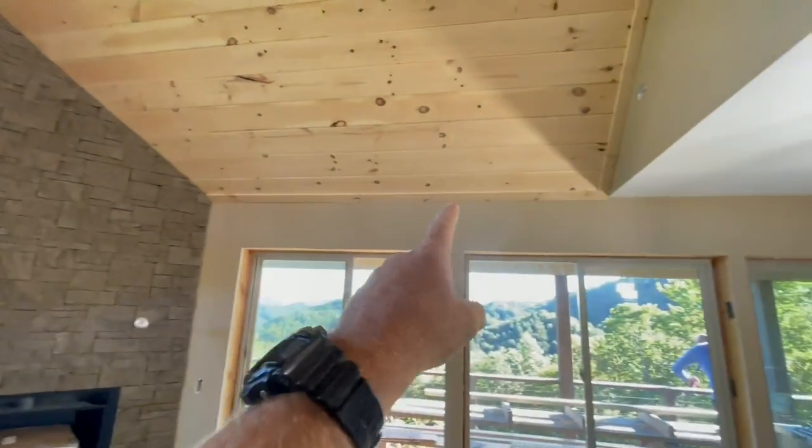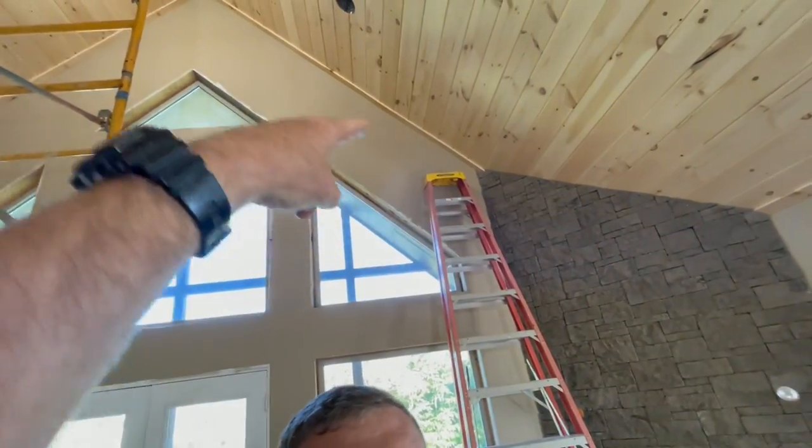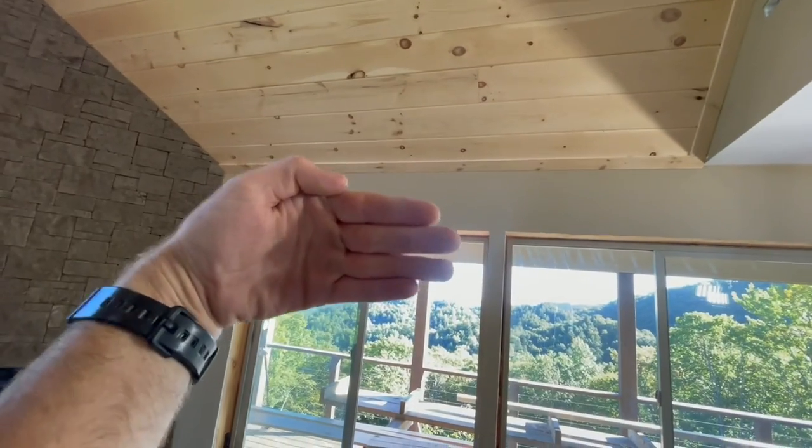All these ceilings — we've got the trim around the edges and there were a couple of really interesting things. The first thing you might want to note is that it's flat against the ceiling. We started doing that because I knew we had solid wood to nail to everywhere. Most of the time there is a double top plate in the wall, but not always. It just looks better. And the other thing is it's flexible in this direction, so the paneling is a little jaggy — up and down — and you can flex the trim to be tight.